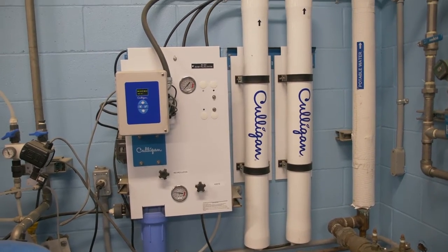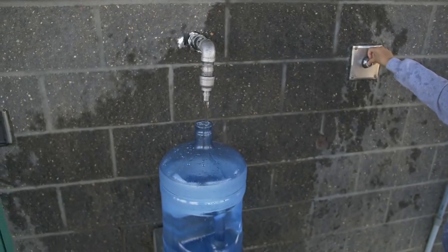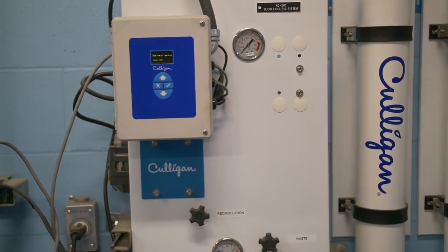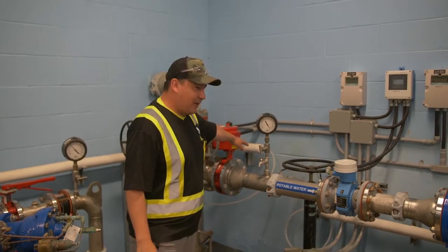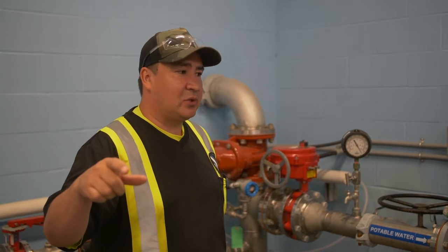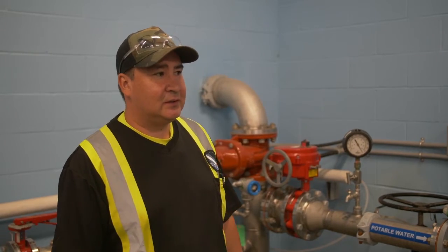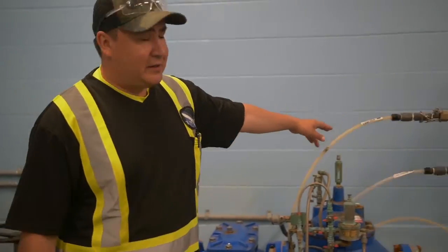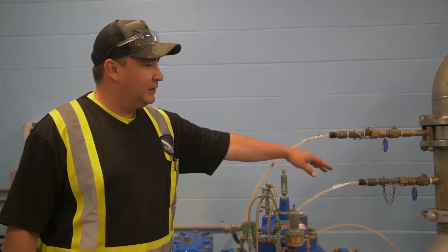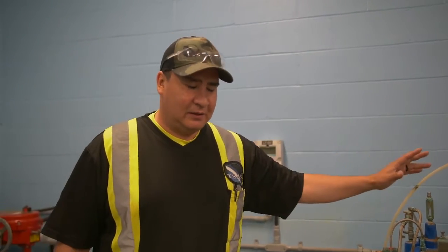This is an RO system for a bottle fill located just at the front door of this pump house. The water supplied to the nation is pumped through here and it kind of polishes it off. Right off the header of the incoming water, a sample is collected and then goes to the chem scan. That chem scan relays the information to the control screen, which then automatically adjusts the pumps and injects ammonia and chlorine at these two points, boosting it if required into the clear well, and from there to the distribution pumps and out to the community.